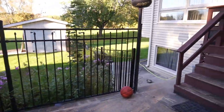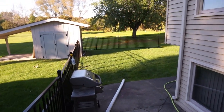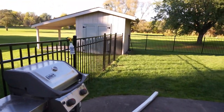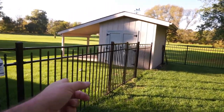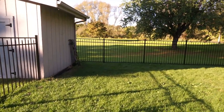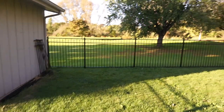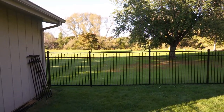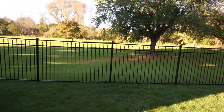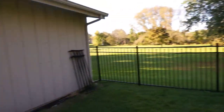All in all, it's a pretty fence. It doesn't look cheap — and it wasn't cheap. I wish they were a little sturdier. The panels are seven feet wide, which is pretty wide. I think they went seven feet wide because they went seven feet long on the posts and figured they might as well use that same length. But because they're extra wide, that means extra forces are applied to them. I kind of wish they had just gone with a regular six-foot panel.